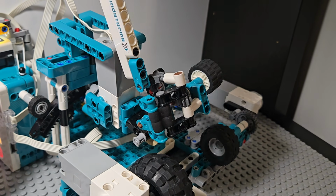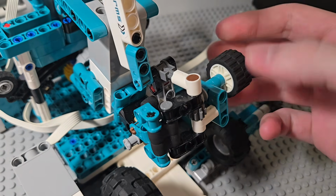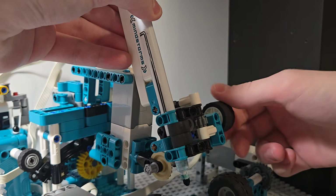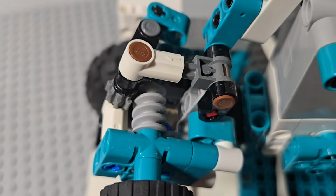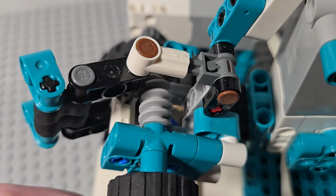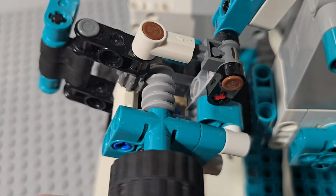The third motor is used to raise and lower the marker. I open this grabber by turning this knob, insert the marker, and then close the grabber. The mechanism for the grabber uses a worm gear that mechanically self-locks, meaning it cannot be driven by the output gear. This prevents the grabber from slightly opening by itself.